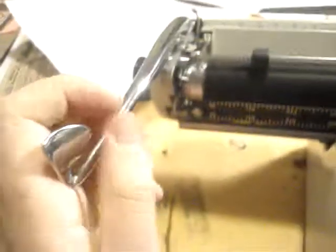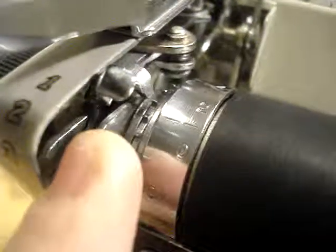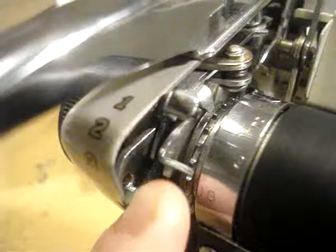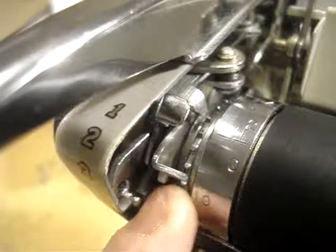The carriage is a bit noisy. This is the carriage return lever and it doesn't work. The reason is because there is a little linkage here — over here you can see — and it's very loose. The reason being is because between those plates there should be a spring, but it has snapped clearly in half.